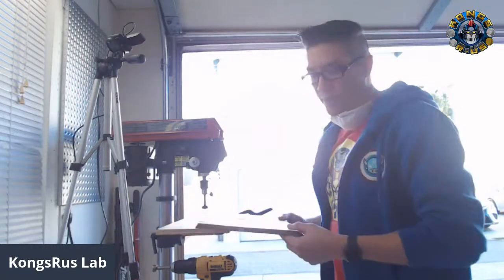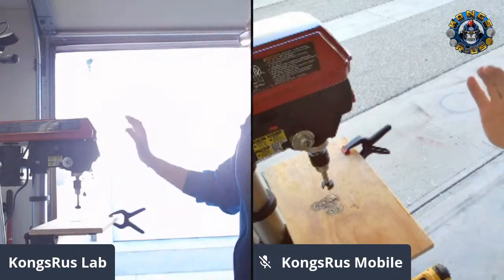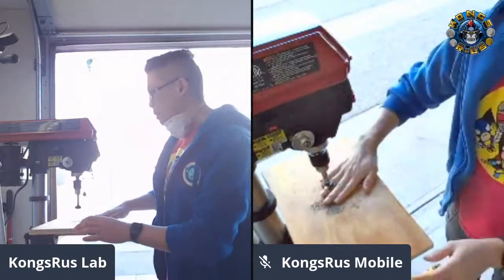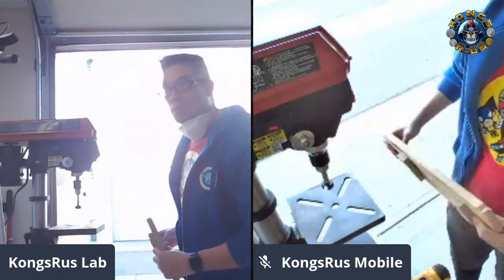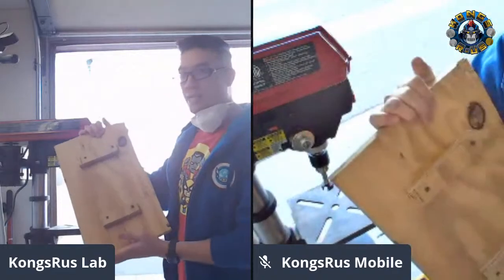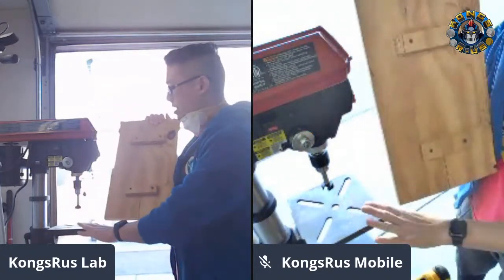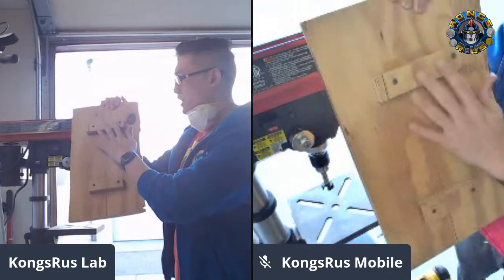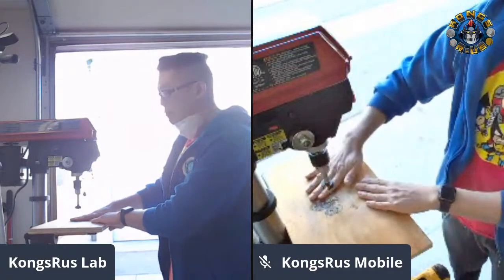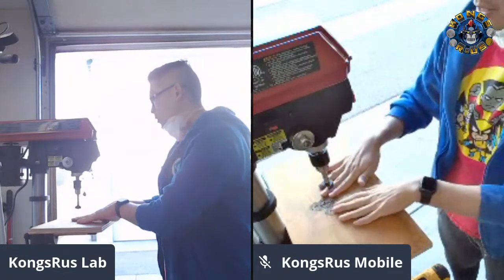When you get the drill press, let me turn on my other camera so you can see. All right, so here is my 10-inch drill press. I had to create this board on the bottom so that I can have an extra board, because normally it just comes with this metal plate here. To have a board here, all I did was take some pieces of wood and make sure once I lined it up with the metal plate, I made some stoppers so this would fit into the grooves. This was just some spare wood. Now it sits here on top, and I have a little bit of a board underneath that, once I drill through everything, will catch the bottom side so I won't have any blowouts.